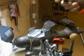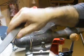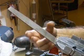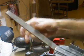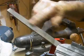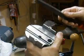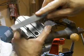You can do this however you want. I'm sure you're creative enough to figure it out. I used a flat tone hole file, which a saxophone technician would have. I do brass instrument repair, so I have access to a flat tone hole file. It's about 1.5 inches wide. It's a very fine cut. It's a double diamond shaped cut. You're not going to find those anywhere. You can barely find them if you're a repair technician. And they're expensive. This, you can use just a smooth mill file.